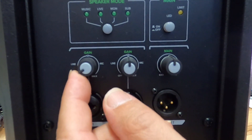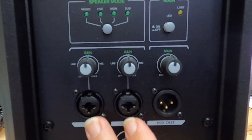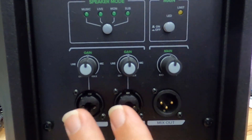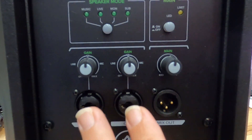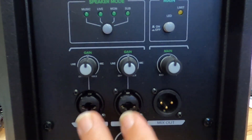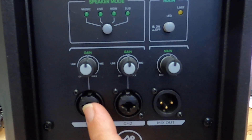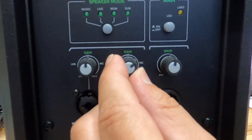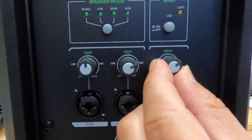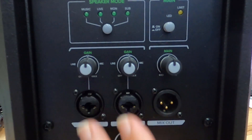For setup on a speaker, if you're using a line level you definitely want to start up at the unity point when you have a master volume. Now why do we have two inputs? If you're plugging in a DJ controller, you're going to have two channels and one speaker, so you'll want to occupy both because it's a bit awkward to go mono off the controller all the time. Both lines — XLR or quarter inch — go in here, and you can adjust the two levels separately. For example, you might have a standard line input for music and also a microphone plugged in at the same time.